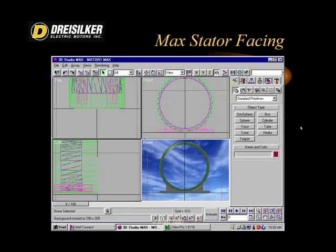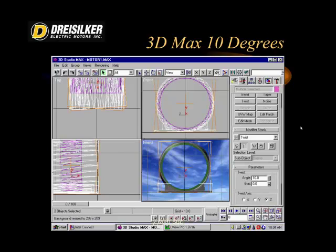Using 3D Studio Max, we were able to apply the twisting and deformation that occurred to the machine directly from the AutoCAD measurements. The AutoCAD drawings were imported straight into 3D Studio Max — at the time, version 2.1 — which allowed us to create the twisting motion. We would exaggerate the twisting enough to identify what the shape would look like, taking what would be a few degrees and making it out to 10 degrees so we could see how the form was misshaping on the stator.